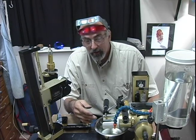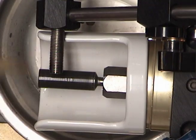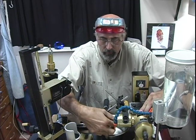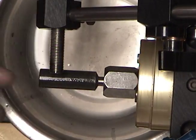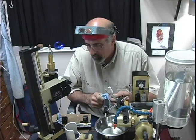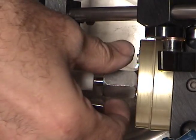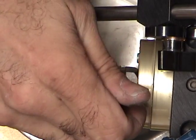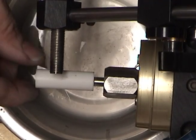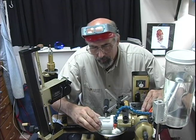Now that we've completed that tier with the pre-polish and final sand of 3000 grit, we're going to change out the mandrel. Remove the splash guard to make it a little easier, then roll this around until you lock the mandrel in place. An important part of this step is to make sure everything is clean because this is going to be our final polish. Available in Corian as well, which is a very fine polishing lap — make sure you clean everything well. This is a Corian mandrel made by Roy Wickman. Replace the splash guard.